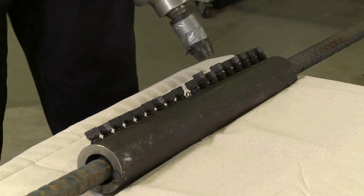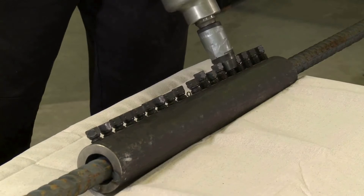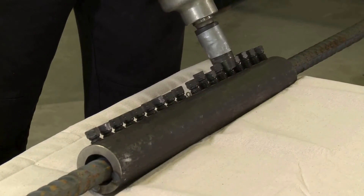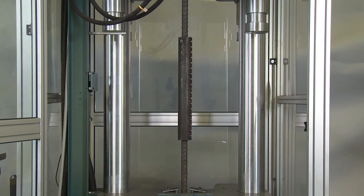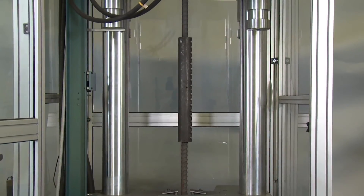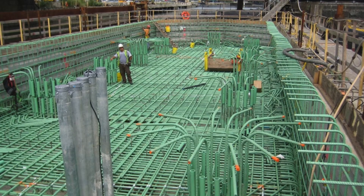It is designed for high loads such as extreme tension or compression and seismic loading conditions. Barlock Couplers have been validated through comprehensive testing to meet yield, ultimate strength, slip, and cyclic requirements as defined in AC133 and ACI318 standards.